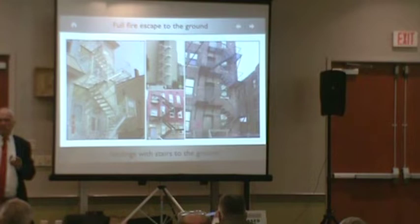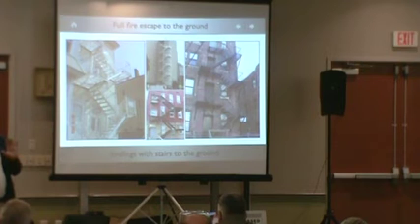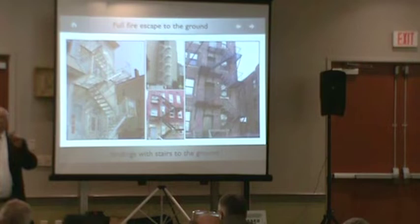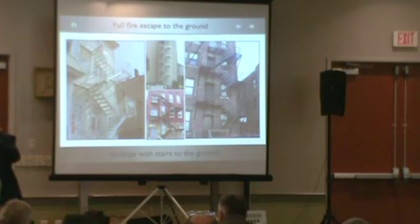There are aluminum fire escapes built structurally sound. First of all, you're allowed to build all fire escapes with metal. Aluminum is metal, metal is metal, right? You can also build a fire escape to match the building type. So if you've got a wood structure, you can put in a fire escape made of wood, and it just has to have a nominal thickness of 2 inch, which is 1.5 inches. Is that a true statement? Yes, sir. Right, so that's a true statement.